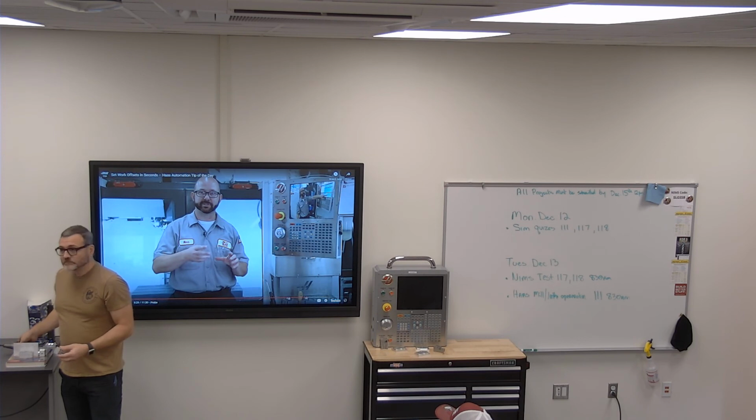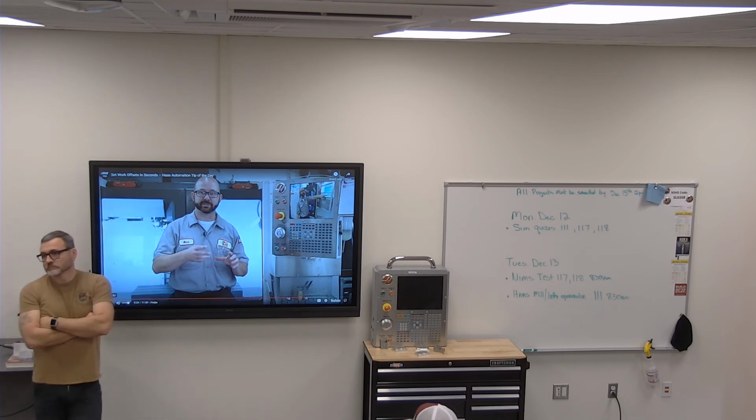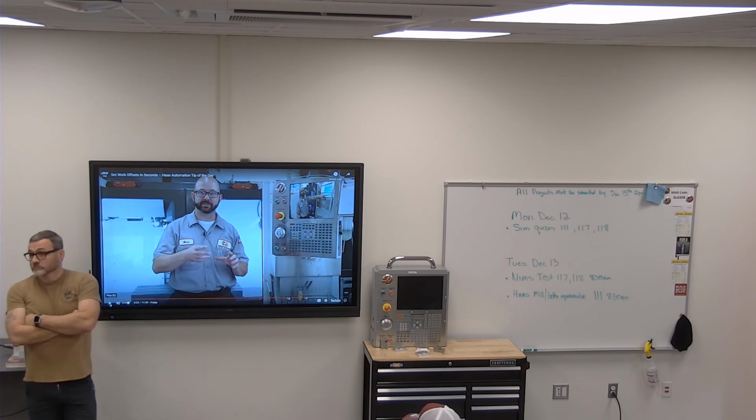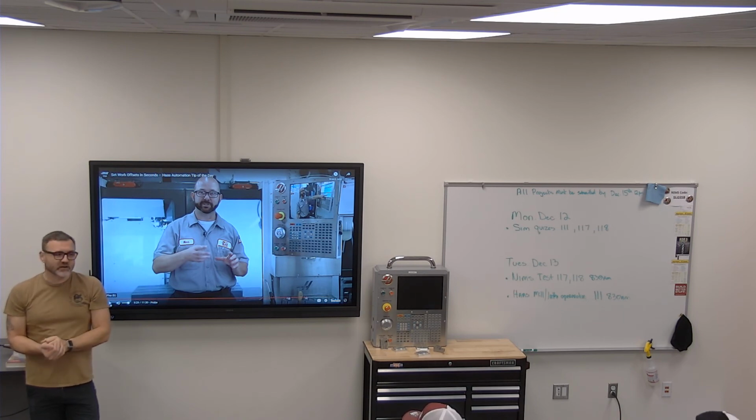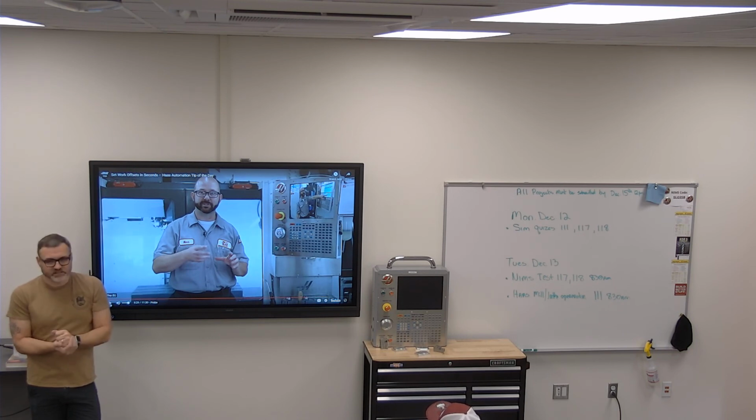So if we're probing Z, and we're at a half inch above the part, to go down an inch, it'll find it and probe it. Yeah, sure, it'll go. You can tell it more. That's what I'm saying, but you don't have to be extravagant. You don't have to go 90 inches when you're 200 thousandths above the part. You want to be like, I just want to be on the safe side. That's ludicrous to do that. So it's going to come down, hit the part, and then go above what it says, and then you'll touch it and go: rough hit, finish it, is how it's going to do it. So just like a CMM would do.